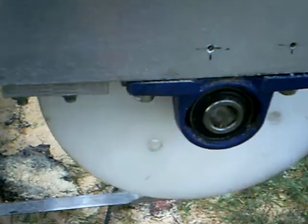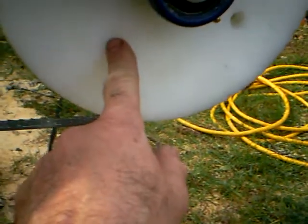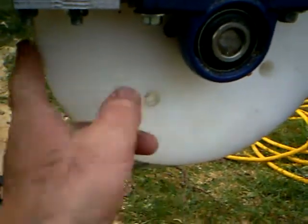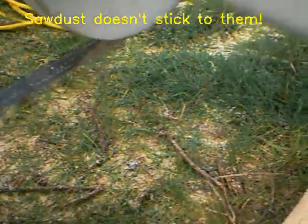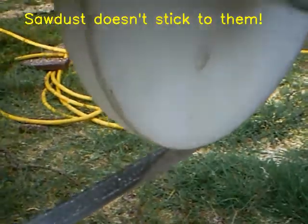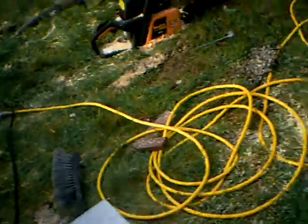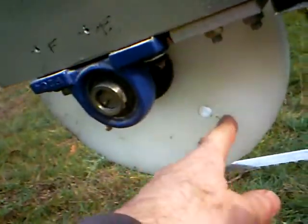Another new feature is the UHMW polyethylene wheels, and they're actually less than an inch thick, running the 3/4 inch band. And what you do is make the highest point of the curve just behind the front, instead of in the middle, then you don't really need that whole front end of the wheel. And it happened also to be the width of UHMW wheels that I had, because I practically found these. I just had to cut holes in the centers.